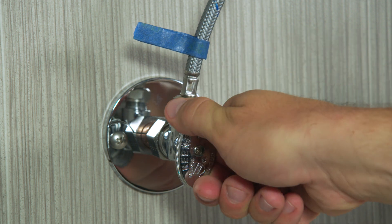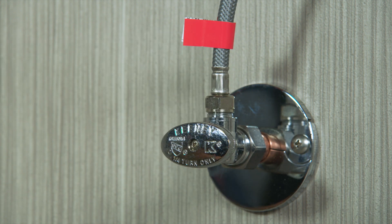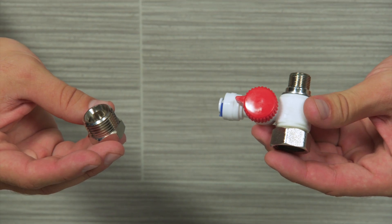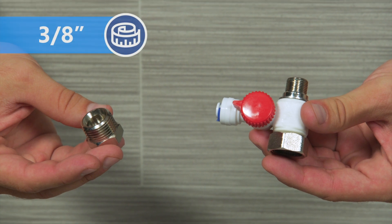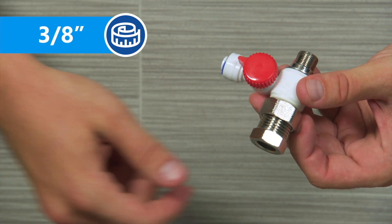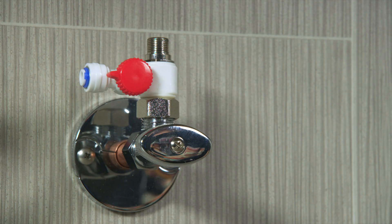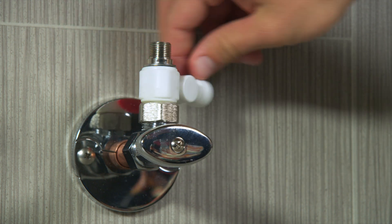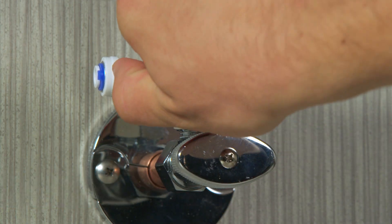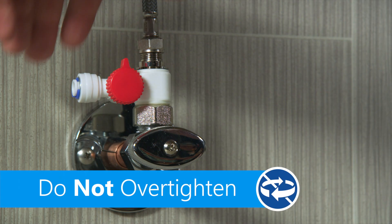Find your cold water supply and turn it off completely. If you have a single handle faucet, turn off your hot water valve. Release any pressure by opening the cold water flow on your sink. The feed adapter can be used for three-eighths or half-inch plumbing sizes. For three-eighths-inch connections, attach the adapter nut like so. For half-inch connections, attach the adapter nut on the opposite side. You can secure the adapter valve either directly to the cold water valve or further up the line. Keep the feed adapter in the closed position until installation is finished. Secure the feed adapter with your adjustable wrench.